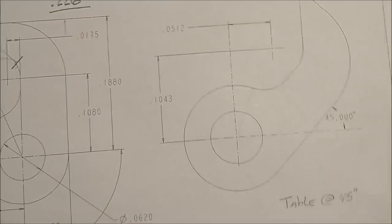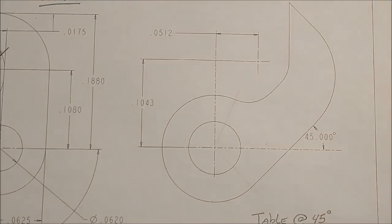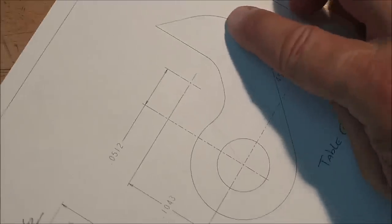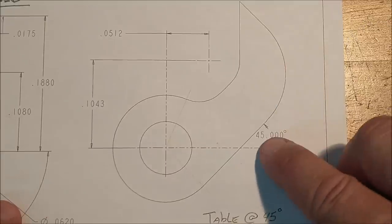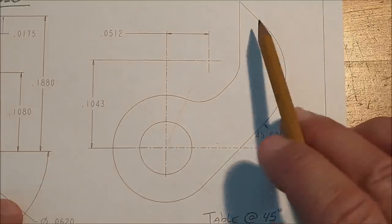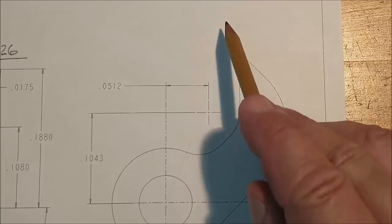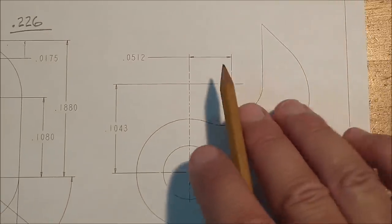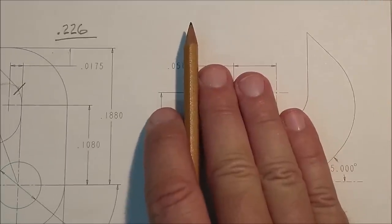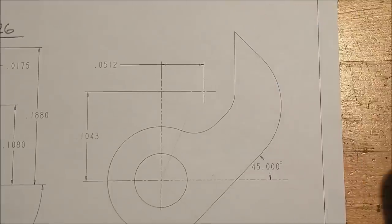On the second side, or actually on the second op, because you're going to have to move the table in order to pull this off, I will rotate that part on the rotary table 45 degrees, lock the table in at the 45 degree number, coming back to that tangent point, drop the cutter back in there, and walk this surface off. If I get real brave, I can offset the entire part, the entire setup, in the machine this way, and interpolate this radius. We'll see.